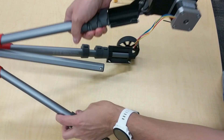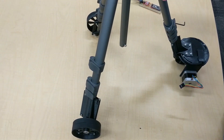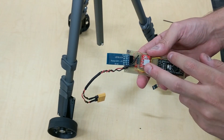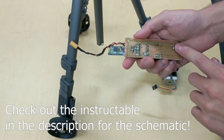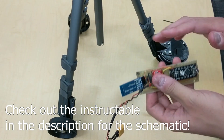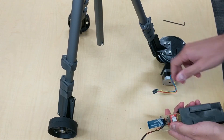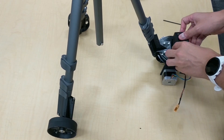Now I can put this up and it's nicely moving back and forth. We have the power to drive it and we just need the circuits. I built a little board here that basically has an Arduino Nano, an A4988 stepper driver, and an HC05 Bluetooth module. There are a few connections to make — those are very simple. We can put this all in a little box, just for protection. Before we box it up, let me connect the actual stepper to this connection here, then we can put it in the box and slide it in.